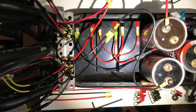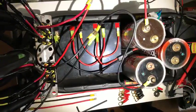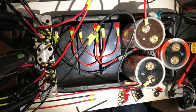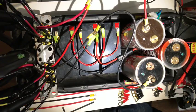Well, the way that we were thinking about that is because Joseph used to work with the RC cars and take them to the track and everything, and you had a really nice quick charger, right? Yeah, it was 40 amps or something. A 40 amp quick charger. And for what we're doing with the alternators, 40 amps should be good. So if those batteries are able to take that kind of charge, then we're thinking of using those.